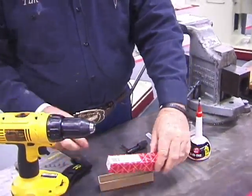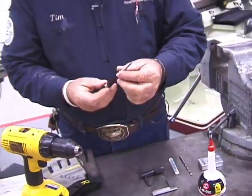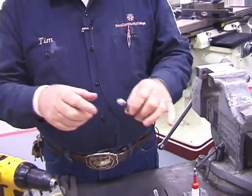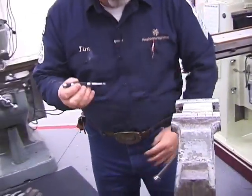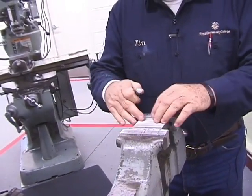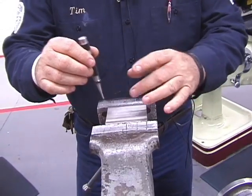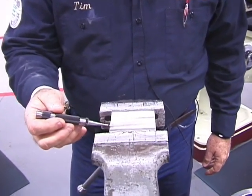Please put the stuff back in the boxes when you're done. Now, this is a special type of center punch — you don't use a hammer on this, that's why there's no hammer in the toolbox. Once you put your piece of aluminum in the vise, be sure it's clamped down. Find an area where you want to drill. You're using a quarter-inch drill bit, so make some room on the edge so you have a basic idea of where to drill.